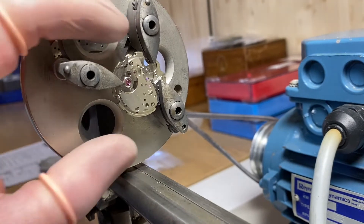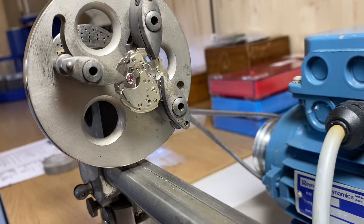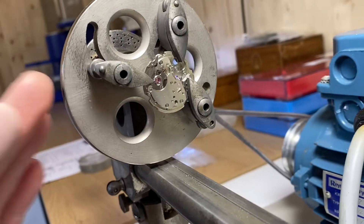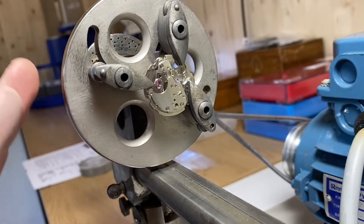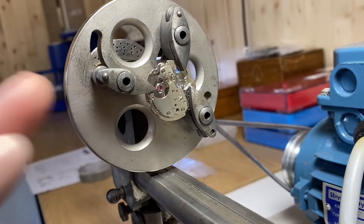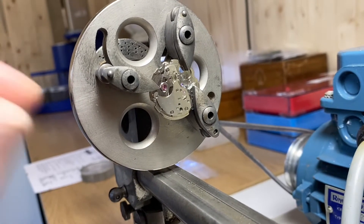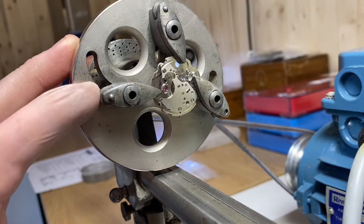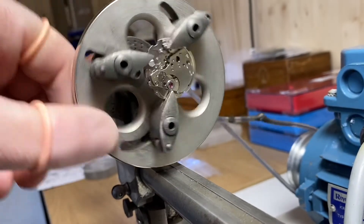It's crucial that we fit this jewel first because if our bottom hole in our main plate is oval, we can't find dead center with an oval hole — it's very difficult. So we fit the jewel first, line it up with the jewel on the main plate, and then we can drill into the main plate. Fit your barrel bridge or train bridge with the jewel, then mount it with the three screws onto the main plate, fit it into the clamps of the face plate in the lathe, and then we're ready to try and find center.